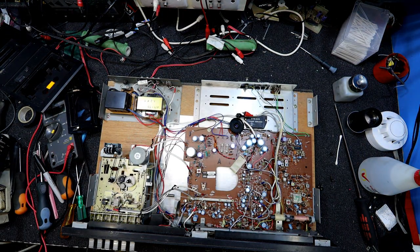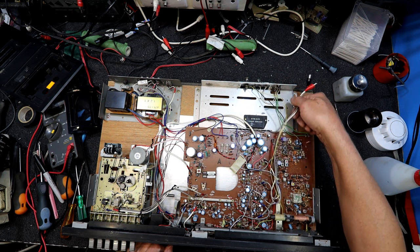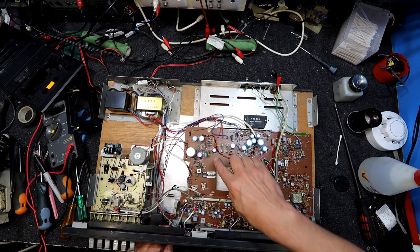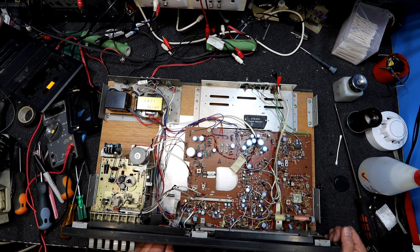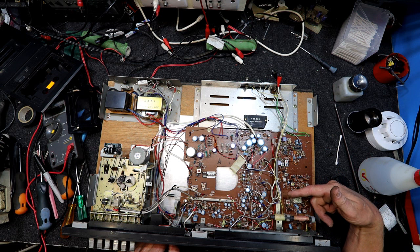I guess it's not really... Well, look at the tape deck. That's not really an 80s thing, is it? Oh, it's actually got a STK433 chip in it. Couple of fuses. Oh, that resistor looks like it's been awfully hot at some stage. There's our record playback switch. Power section with transformer. Quite a bit in the radio, all discrete. Well, there is one chip there, but I think the radio itself is all discrete components.